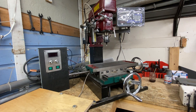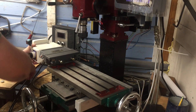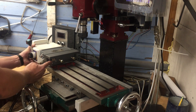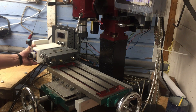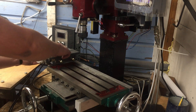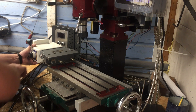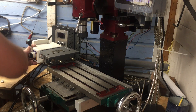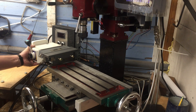These units are basically designed to fit a few machines specifically, but overall they're universal — one size fits none. The way this is supposed to work is it sits on the table like this. Right now it's hitting the lead screws so it's not going to go all the way down. This bracket is going to take up a lot of space so you're not easily going to be able to get T-nuts in and out. It was also going to require a shorter lead screw and the gear much closer to the end of the table, resulting in reduced travel. So I decided to fabricate my own bracket and do things a little differently.